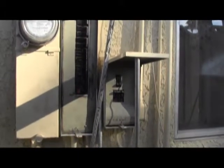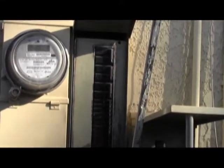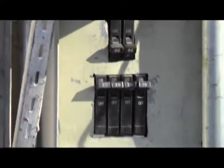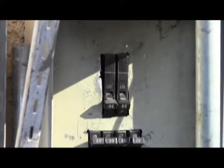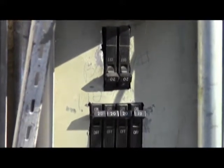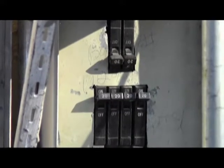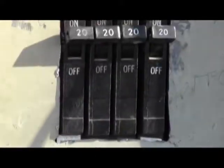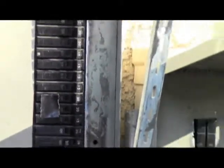As you can see, we've got two dead fronts complete. We have this one, which was done using a grinder — which is quicker and a little more accurate — unfortunately I burnt through two grinders made from China. And on this one, I used the method where I scored where the holes were going to be, drilled out a series of holes, chiseled that to where I could get a sawzall in it, and then sawed out the holes and filed it out so it was square. While not as pretty, you can see they were just as effective — they're put in there very accurately. The only thing that needs to be done is to have these labeled, and I can't do that until the house is trimmed out.